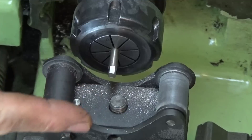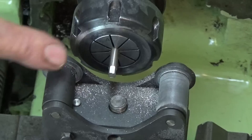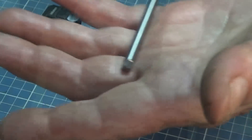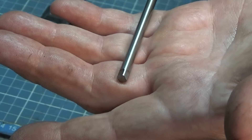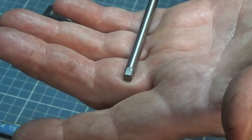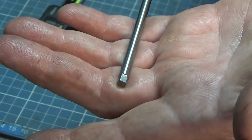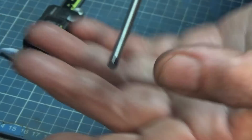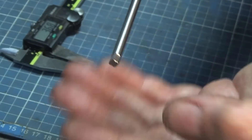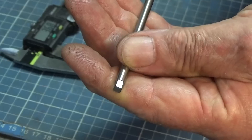That's finished. I didn't machine the end of the stock here so it's not cleaned up on that end surface. Let's take this out and have a close look at the square. There's a good close-up look at the surface finish you get on that stock. I just used a hand smooth file — if you want better than that, just get a brand new file. I don't use any lubricant, I cut this dry, because oil or WD-40 will make the chips stick to the teeth of the file and build up on the rollers. If you don't want the little rounds on the corners, you just lower the whole device — there's a screw mechanism underneath that allows you to lower the rollers down and cut deeper to get rid of those rounds.